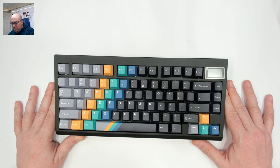So I still have one more clip I disengaged. I'll go ahead and test them out on a keyboard tester once we've gone through, because as careful as you might be, you might bend a pin or two on the switches. Thankfully, as long as you're careful, you can bend them back into place and put them back in. And even though hot swap sockets should be held with a little bit more than just solder, because solder should just be for the connection, I think they have gotten better over the last year or so.